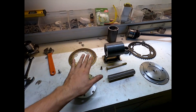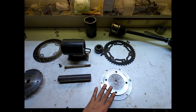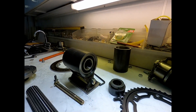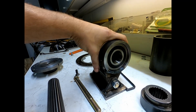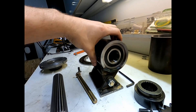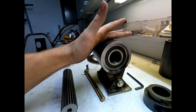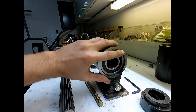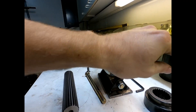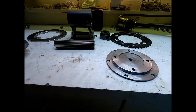Alright, we are back. Here are all the various parts for the rear end - super simple. You've got one, two, three main parts and you didn't have to build most of this. Let's start with this one - you can see the chain tension right there. It's pretty nice because I can set it forward when I put the chain on, then rotate it back about an inch and a half to two inches - that's way more than enough - so you won't lose your axle height.